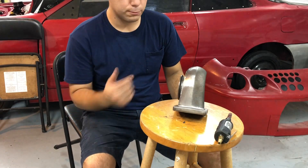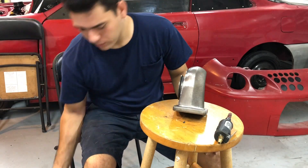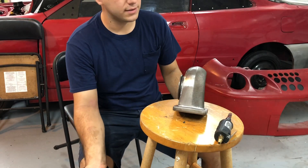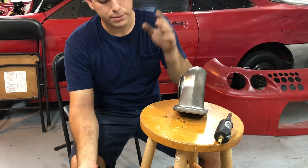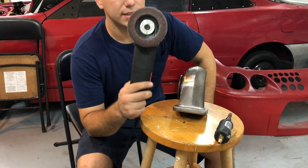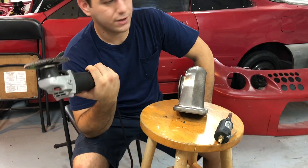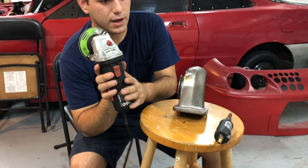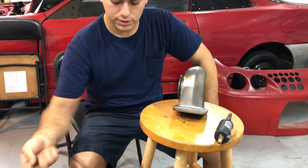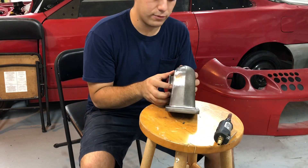It was very simple to do. This portion right here took me about five minutes altogether. A lot of people will say you have to go through different sanding processes, especially on aluminum, because aluminum cuts very fast. But with this material, since it's such a heavy-duty material, we use a very simple 60-grit aluminum oxide sanding flap disc — that's just what I got at Harbor Freight. You can pick this up for like three or four dollars, and the actual grinder you can get for 20 bucks, anywhere from 20 to 60 depending on the brand. That's going to be what cuts the main components. You're basically just sanding it down, and right off the bat you can see how the finish is different.